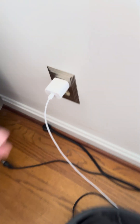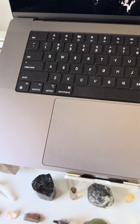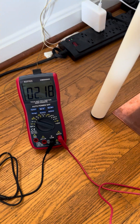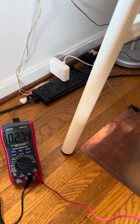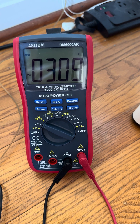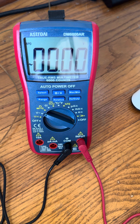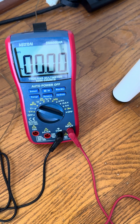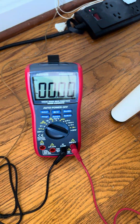Let's plug this back in one more time. I'm going to plug the power strip back in and turn that on. My computer is connected to the charger. Now, what happens if I'm holding the voltmeter? I'm at two volts. I'm going to hold this with this hand and just rest my hand on the mouse — it goes up to nine volts. Take my hand off the mouse — three volts. Put my hand on the mouse — nine volts. If I put my foot on the copper plate with my hand on the mouse — zero. Even when I have my hand on a wired mouse, it is still sending electrical signals to and through my body, but the copper plate helps negate that and grounds me.